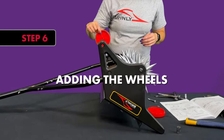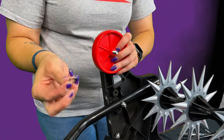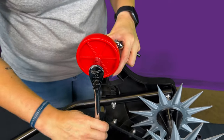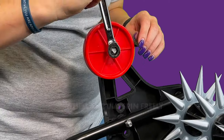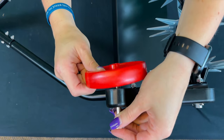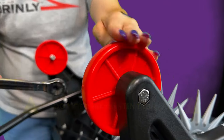Step 6: Adding the Wheels. Add a wheel onto the inside of the side plate by aligning the hole of the wheel up with the hole in the extension of the end of the side plate. Pass a 1 and a quarter inch carriage bolt from the outside through the side plate and the wheel, and add a washer and nylon lock nut to secure the wheel in place. Do not tighten fully — ensure the wheel can freely spin. Repeat this step on the other side, adding a washer and a nylon lock nut, making sure not to fully tighten so the wheel can still spin freely.